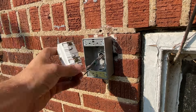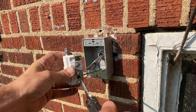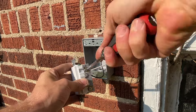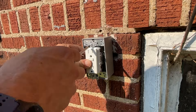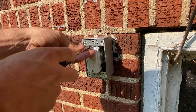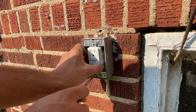We'll be using a technique called back wiring for the neutral, ground, and hot side. Always good to do ground first and make sure it is securely held. Then go ahead and do the black hot side, and the silver terminal goes to the white neutral side.